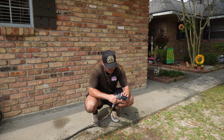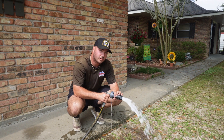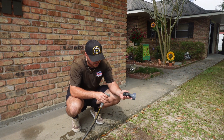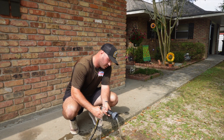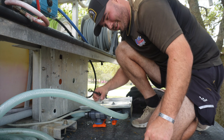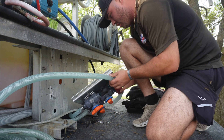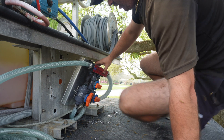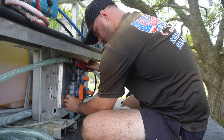This is the correct way it should flow — arrow going that way, liquid to flow. Liquid's not supposed to flow this way. No good. Bad check valve. Got a bad check valve on our water valve. So it's back feeding water whenever we start filling up our water tank — it's back feeding water into the chemical tank.